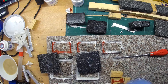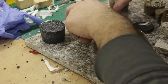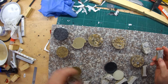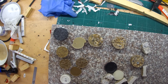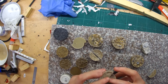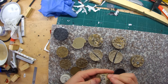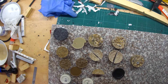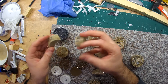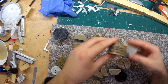Overall I'm generally pleased with the results, although I don't know if I like the fine silica fume powder — it seems to dry out the mix quite rapidly. I've also got an assortment of various mixes and other formulations I tried in the past using as much as 22% epoxy by weight, however this seems to use too much resin and it gets wasted. The industry literature points towards an ideal of 7–8% resin by weight, but I find that for me a 12% epoxy by weight is a much better formulation. It seems to flow better, and once I solve the vibration problems I should get a really good result.